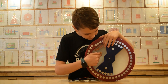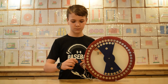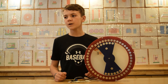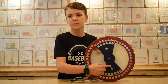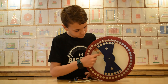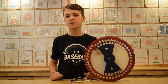Here we have a small trigger coil, and down here we have the actual trigger. We also have two permanent magnets — one on each of the two arms — for the timing of the motor. They will trigger the trigger coil, which will allow the electromagnet to be energized and push the rotor away.